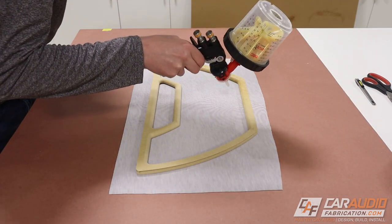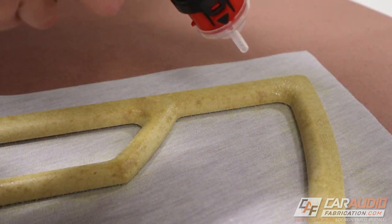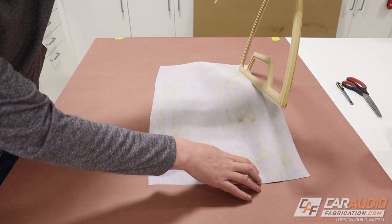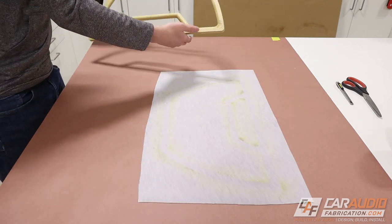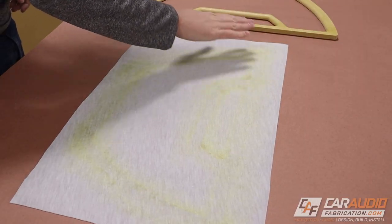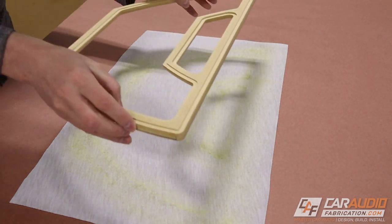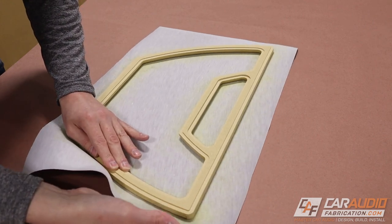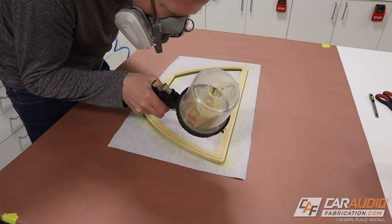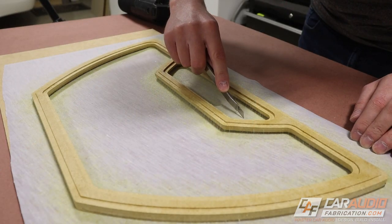Here's an important tip for when you're starting your upholstery process. I recommend that you start with having your piece on top of your vinyl even though you're spraying the front side of it. The advantage is I now have the front of the wooden piece sprayed, but I also have a nice outline on my vinyl so I know exactly where to apply the material without wasting it. The way that contact adhesive works is we want to make sure it's good and dry before we stick the two pieces together, because contact adhesive works by adhering to itself. I can now apply more adhesive to the back side of the panel and allow that to dry before I start making my cuts.